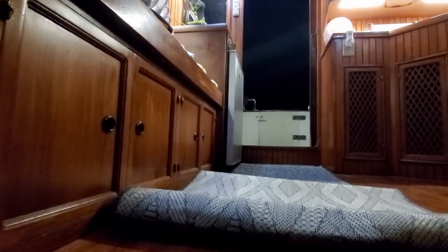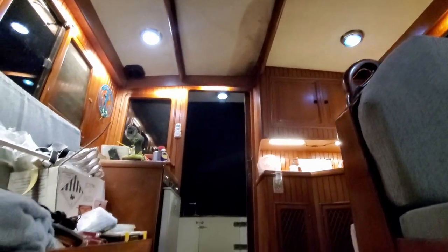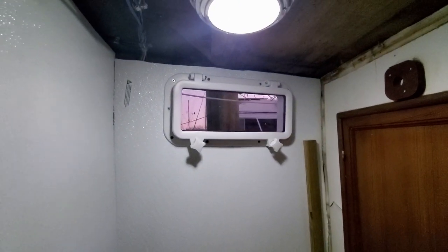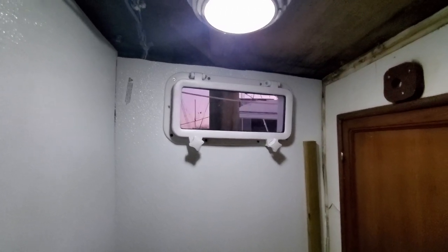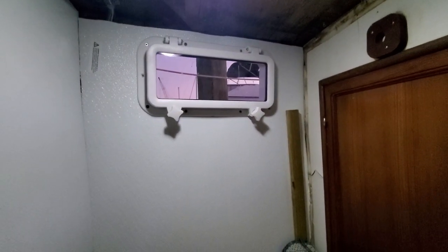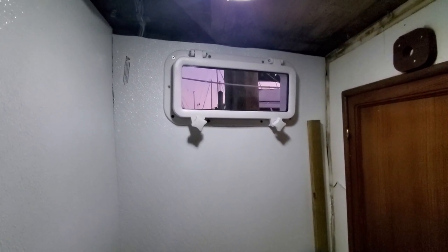The interior is a lot better than the rest of the boat — motor, tanks, and driveline still need work. Working on the lighting now. Closets are in progress, and there's a new window. This is that Home Depot textured stuff, set in place and held with glue or 5200 and then screws from the inside and outside. The window needed a little cutting but it's much better than the old one. Got a lot of cleaning, taping, and re-caulking to do, but for tonight it's in and waterproof.